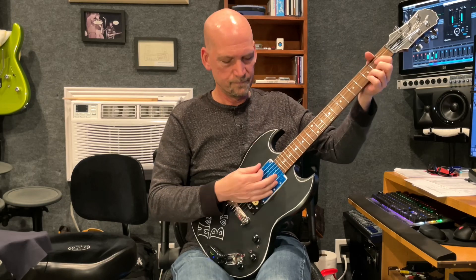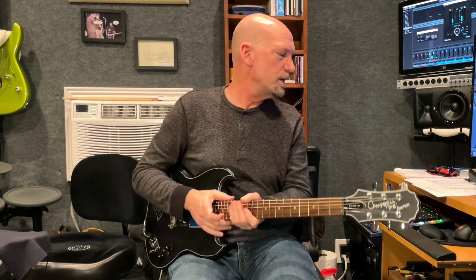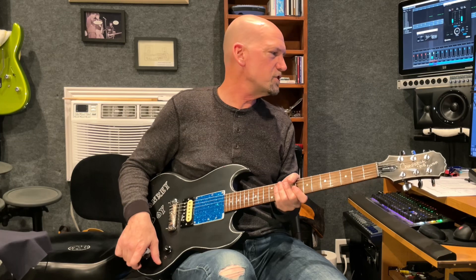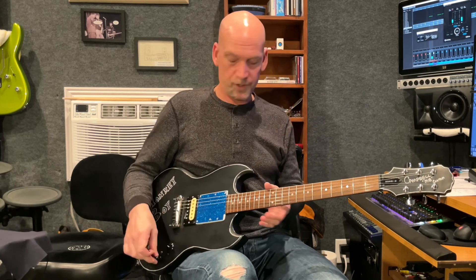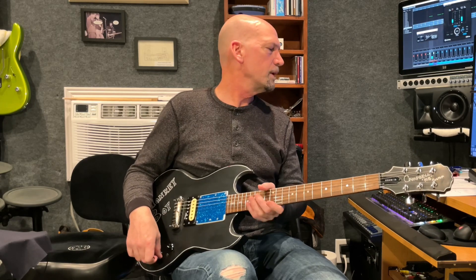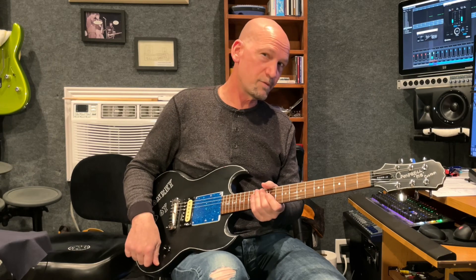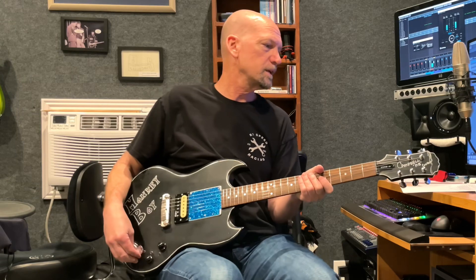Full humbucking sound. So I used several different resistors and capacitors suggested in that article and kind of went from there. The way I have it set up: the sixth position is no load. First position on the resistor switch is 2K, then 3.3K, then 4.7K, then 6.8K, then 10K, and then no load.